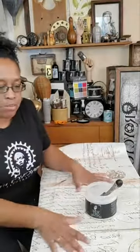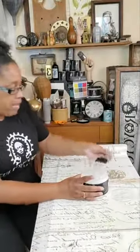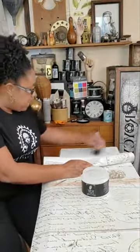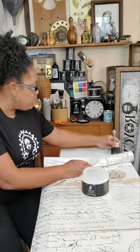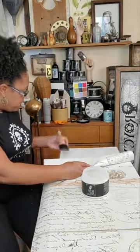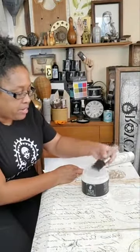The sides — it's the same thing. Catherine's asking if I would follow the same process to decoupage on the sides of drawers: absolutely. Using the varnish means you're going to have a durable finish when you're done. When you use varnish, it doesn't cure right away — even if it's dry, it's not necessarily cured. So when you're decoupaging, you want to give your pieces time to rest before you start using them. For drawer size, I would have my drawers sit out and chill for a couple of days before I put them in the dresser, and probably about 10 days before you deliver to your customer.